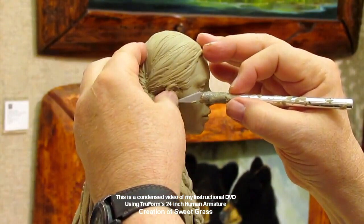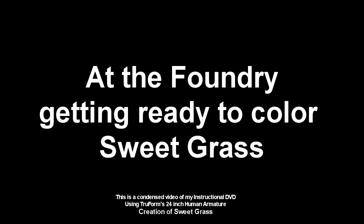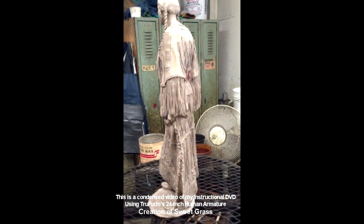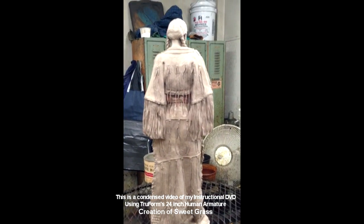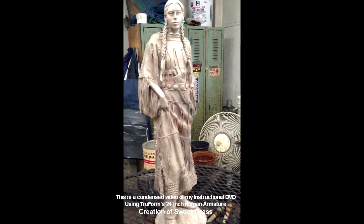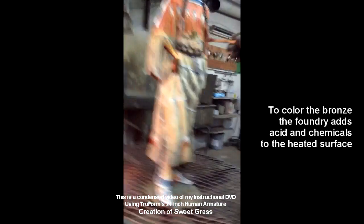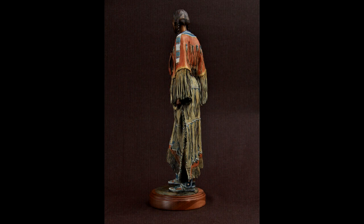I'm also working on the face and finishing up things — like adding an earring here and an earring on the other side. These are all separate DVDs, by the way. I show you the original bronze — this is the actual color of bronze once it's cast and sandblasted. It's actually a white metal that you can polish up and make it look like brass. And then here the guy at the foundry was putting on the patina, which is done with acid and heat. And this is the final bronze.